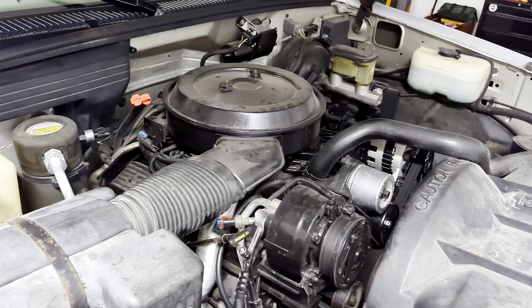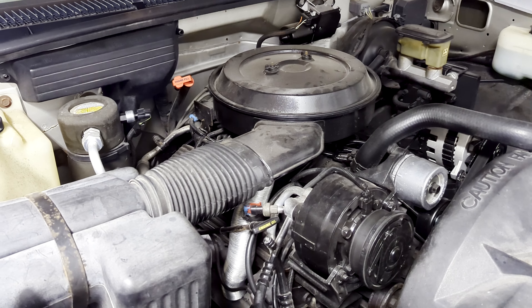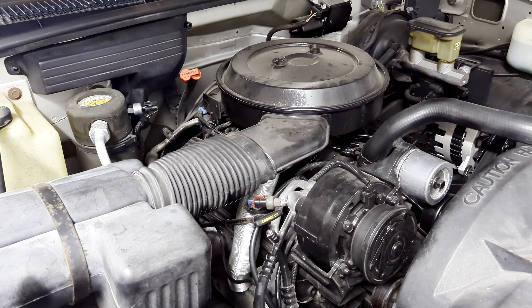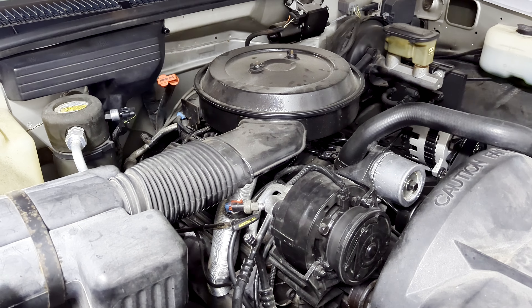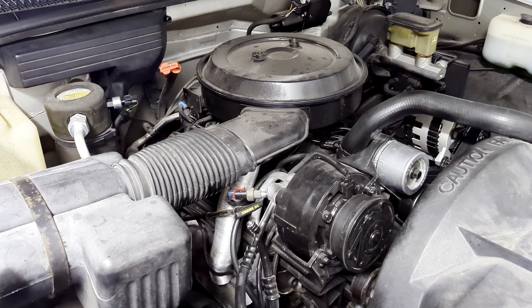Some of the things I've already done: I've checked the pressures and filled the refrigerant — I've got a video for that. My pressures are pretty good. The low pressure is where it should be. The high pressure is a little bit low, so I know that the compressor isn't working at its full potential. To me that means I probably need to change the compressor.